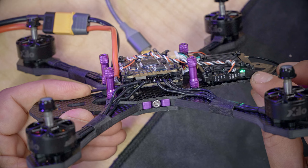My goggles are on 3237.10 because I don't want to be on a beta firmware just yet because there are some issues with it. I don't want to take up a whole bunch of your time trying to sort this out. Suffice it to say, you would like to have them on the same firmware. If your video transmitter comes with 3339.10, I guess you're going to need to update your goggles to 3339.10 as well. Although probably by the time you're reading this, there will be another official firmware that will actually be what you will flash to. But there's one other problem we've run into, actually.